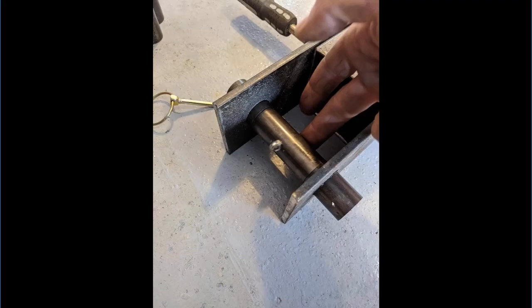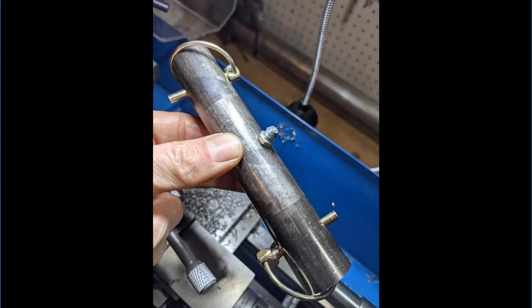This is after taking the bushing stock and trimming down the half-inch bar that I have for the pin on the inside. I also had to drill out the Zerk grease fitting and thread those holes. This is a mock-up of how that's going to go into the top of the boom arms. You can see the grease fittings and the linchpins. In some cases, where there wasn't enough room, I switched from linchpins to regular hairpins.